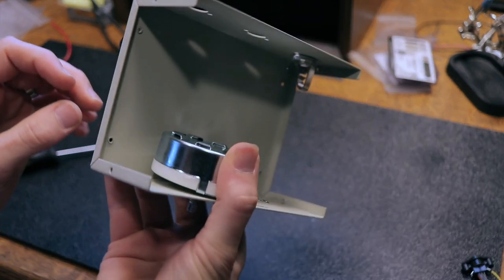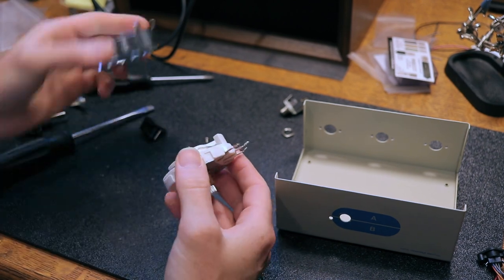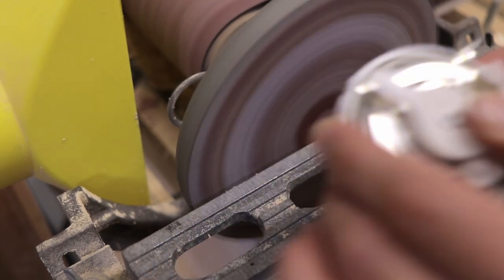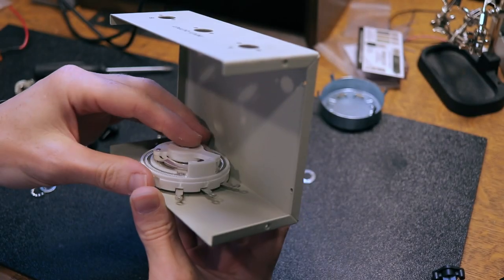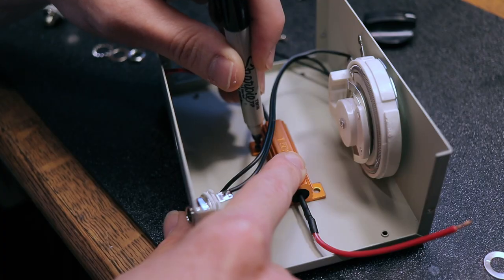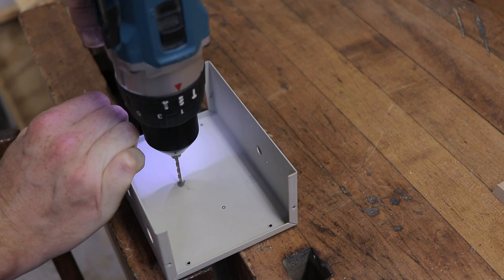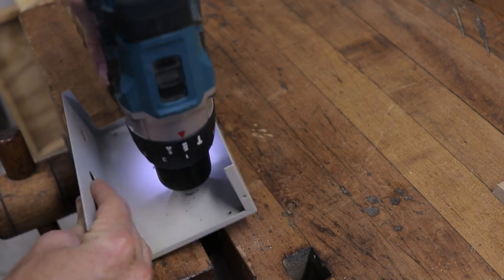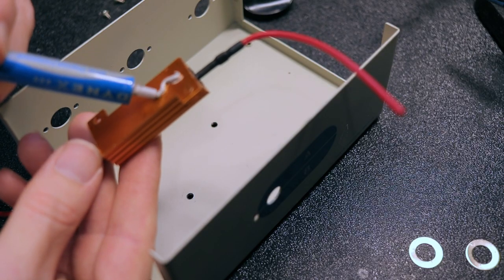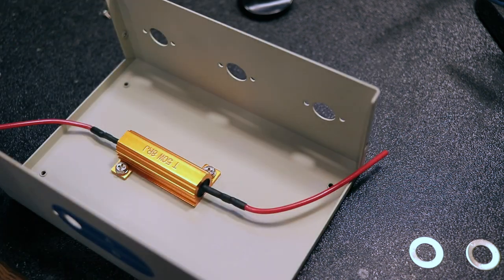The L-pad just barely didn't fit, but I could take the metal cover off the back and then ever so slightly sand down the plastic housing on the disc sander, and then everything fit perfectly. The first thing I did was lay out where the extra orange resistor needed to go on the bottom middle of the box, drill the two mounting holes, cut the threads with a tap, then put some thermal compound on the resistor to help it stay cool and use the enclosure as a heat sink.